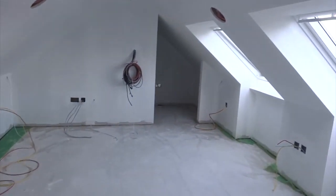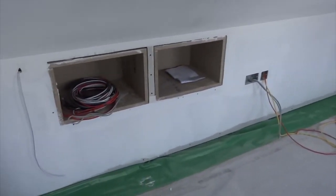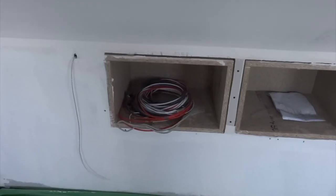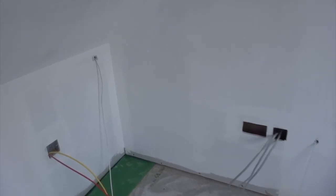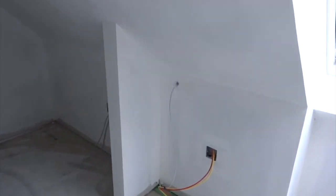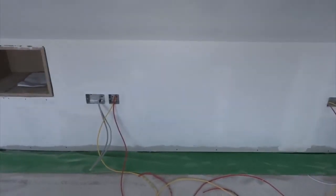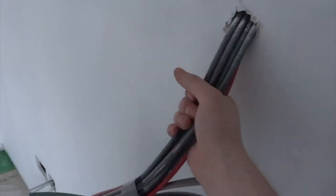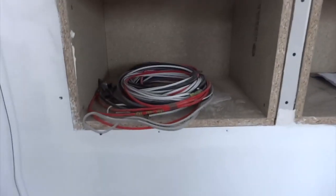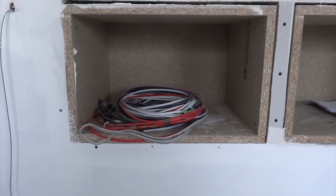On the other side, this is our other cinematic room setup — pre-wired for Atmos 5.1.2. We've got some Hilton shells in the eaves for local input components. Here's our rear left speaker, rear right, our height speakers, left, centre and right speakers, and a coax going in for the subwoofer. We've got loads of voice data points up here just because we didn't really know what the room would be used for in the future. And then there's a small storage closet — there's quite a lot in this bundle that goes back to the head end. So we'll have the AVR in here along with a PS3 and a few other things, and this will also have access to the AV matrix.